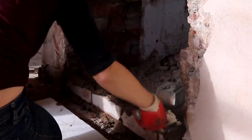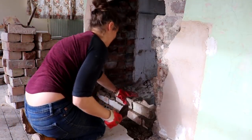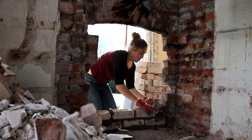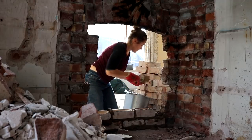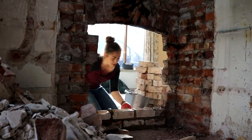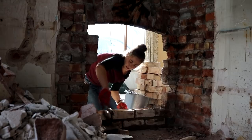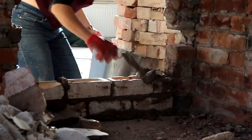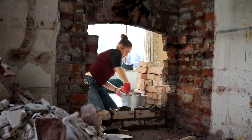So now for my next course of bricks, I'm adding more mortar, attaching it at the sides as well. And then for my running bond as I mentioned earlier. I asked about whether the bottom course where the bricks join needed to be dead centre of the brick above, and apparently it didn't matter as long as it was enough for it to be structurally sound. So my second course was done. I'm using the baton method again, tapping from behind, then placing the baton on top to check if it was alright. And you'll notice it was messier from behind, but I'll be scraping off the snots later — that's another term that I learnt. So that is gobbo and snots.